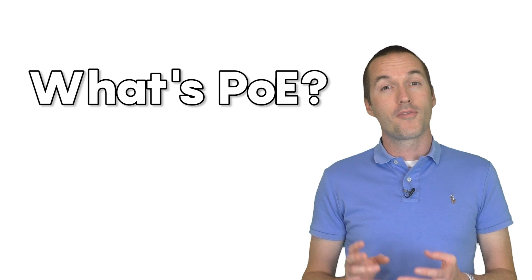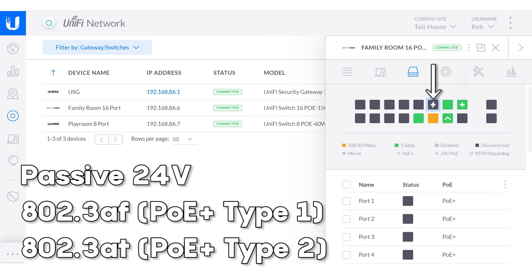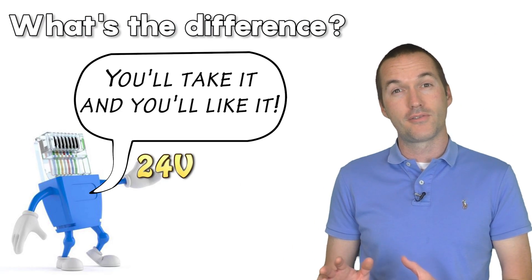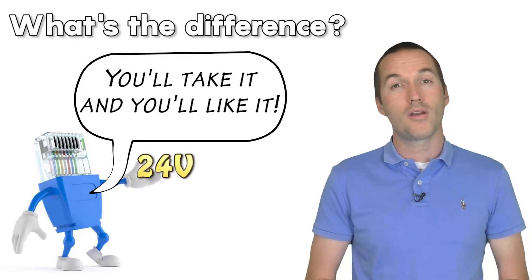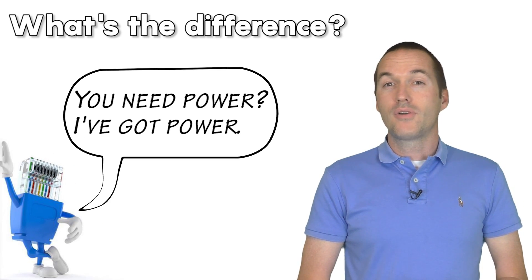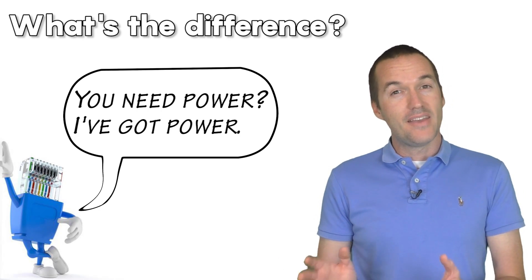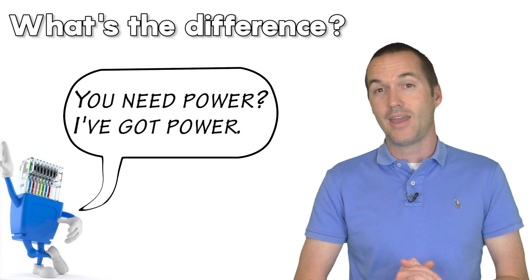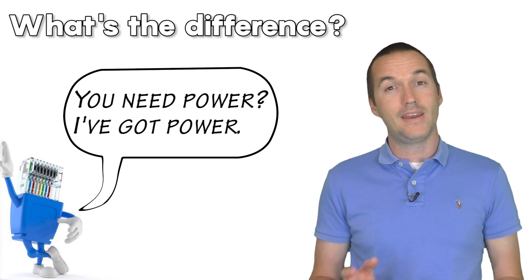Power over Ethernet is a method for providing power to your devices without connecting them to an outlet, and it comes in three common flavors: Passive 24V, 802.3AF, and 802.3AT. Passive PoE constantly sends voltage through the ethernet cable regardless of what device is connected — if you plug in a non-PoE device it will likely destroy it or at least damage the network port. The 802.3AF and 802.3AT standards involve a handshake process where the device requests PoE and determines if the switch can supply the correct voltage before any current travels down the cable. This handshake prevents you from accidentally damaging your devices and also removes a step of configuration because each device will regulate its own PoE.